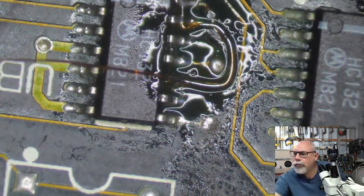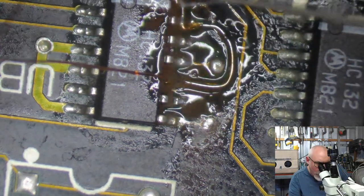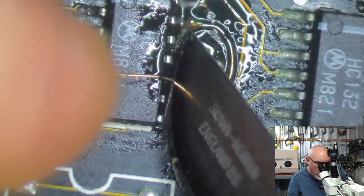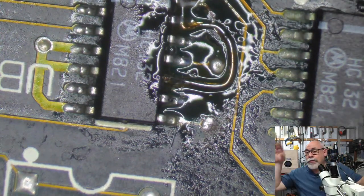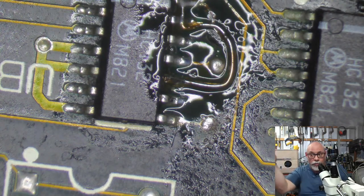Okay, so it works on real drives. Well, it certainly doesn't work on SCSI 2 SDs. I have definitely tried that on a SCSI 2 SD set up with multiple IDs. Not multiple partitions, multiple IDs. So I'll have the SCSI 2 SD set up with IDs 3, 4, 5, 6, something like that. And I hold down the keys and it makes no difference. It just always boots from the top one, boots from six.